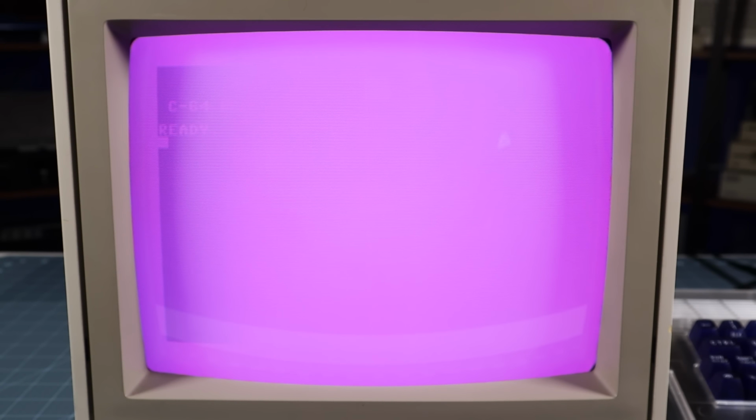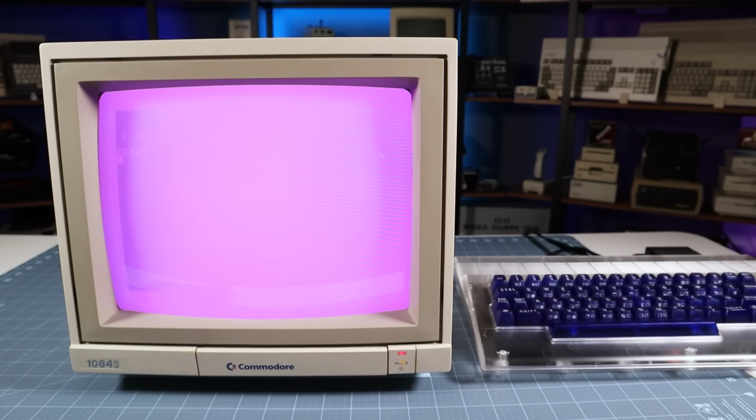It can't be a problem with the tube or electron guns because RGB is fine, so I'm thinking it must be related to the NTSC color decoding circuit. Now, apparently, I don't know when to call it quits, so let's set the sunk cost fallacy aside for a moment and jump right in.